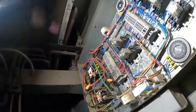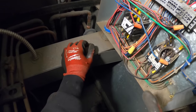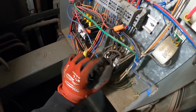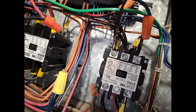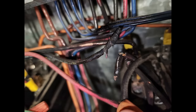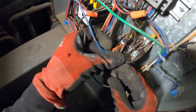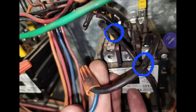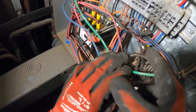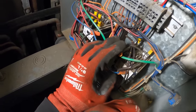It's not good but it's good — might be able to get them up and running. This one looks like it was recently changed, this one just burned. This wire is sitting open, touching from one phase to another. And this one completely just burnt off — I touched it with my fingers, this thing is crispy.